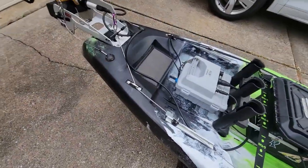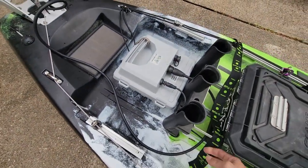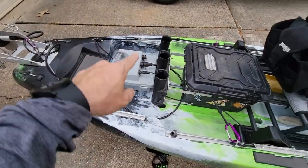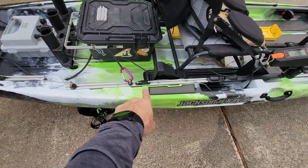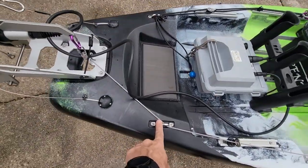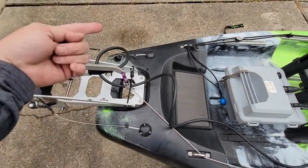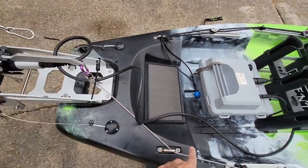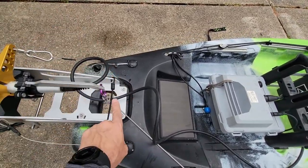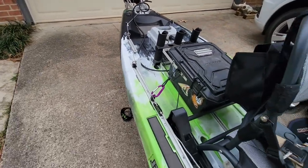The Torpedo is rigged — this just came back from Lake Woodlands. For the Torpedo motor rigging: two eyelets to the cinch, three eyelets to the cinch out, utilizing the strap and through the hole so that you're vertical on the pole. You don't want to torque this motor shaft to either side by leaving it all the way out — you want to get as vertical as possible.